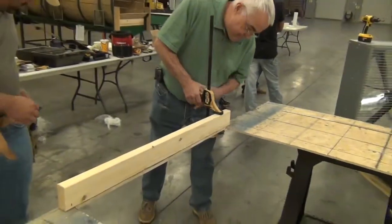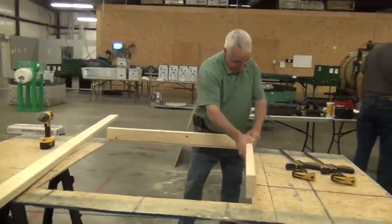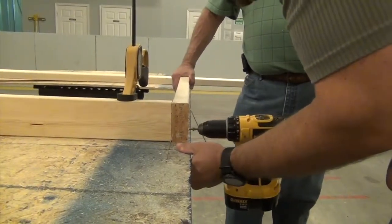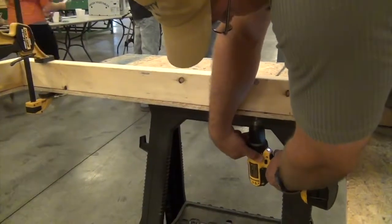Once it's in the right location, secure it with clamps and screw it into the OSB from the bottom. Once the top 2x4 has been screwed in, it's time to add the frame on either the left or the right side. Your side 2x4 frame should line up perfectly with the top 2x4, and you'll screw those together first. And then using clamps again, we're going to secure it from the bottom with a screw every 10 inches or so. Since this will be around the fan sitting on the pallet, we won't have any boards along the bottom.